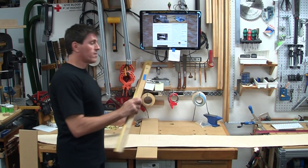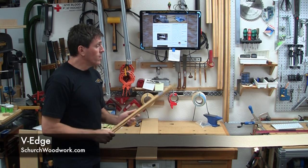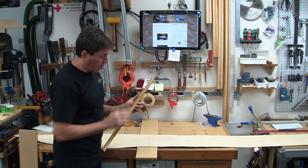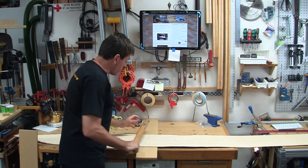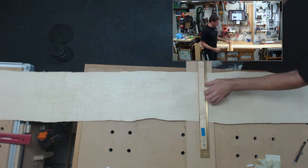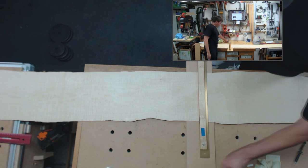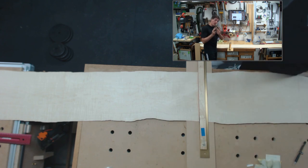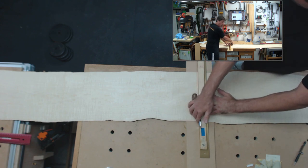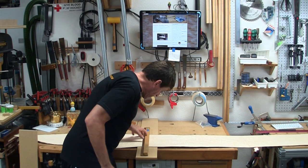And now for this, I'm going to use a guide that I got from Paul Church. He sells these online, actually, from his school. It's a brass rod. On one side, it's got a beveled edge on it. The other one is straight, along with this plywood that's got a handle. It works out really well that you can put this on the line that you want. We don't have to be super accurate on this because it's oversized. But if you needed to be super accurate, in the case of marquetry, what's nice is you can get that right on there, and then this saw blade is going to run exactly on the edge. You can push it up against the side and you're going to get a nice 90 degree cut. So it's a really accurate way of doing it. So let me go ahead and cut these pieces here.